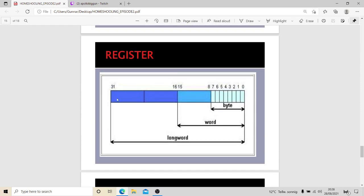Please keep this in mind, how the order of the bytes is. This is different to the PowerPC order, and this is different to the order in the Intel CPUs. The PowerPC also has the byte order the same, but for sake of confusion, the bit order is inversed. So bit 0 is the most left, and the highest bit is the most right. Please mind that the 080 does extend all registers to 64 bit. So in the 080, the registers have not 32 bit, 0 to 31, but 0 to 63.